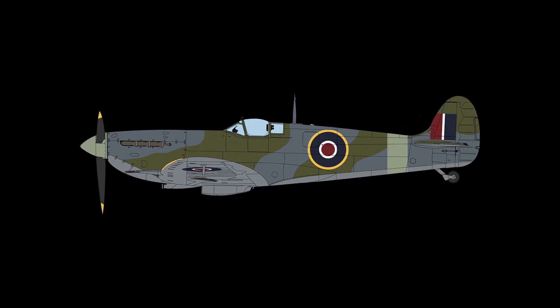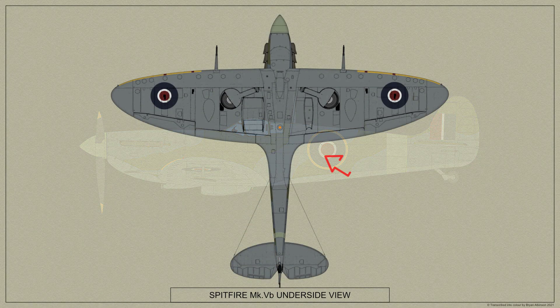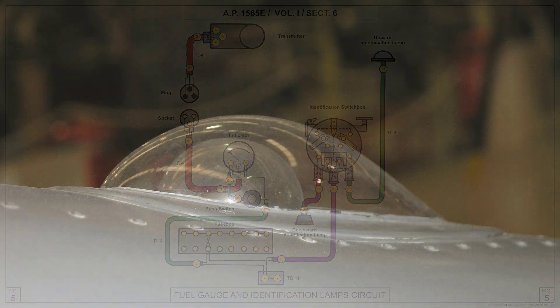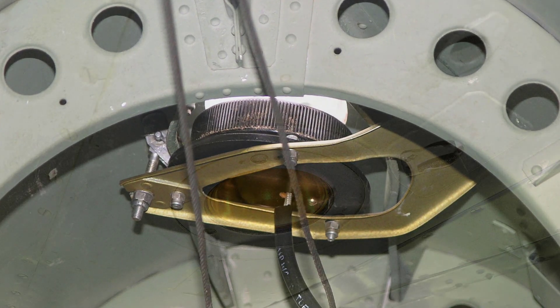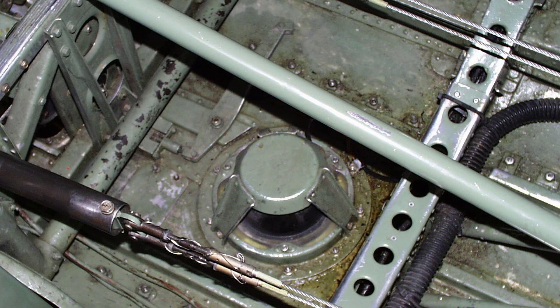The tail navigation lamp is inserted in a holder inset in the trailing edge of the rudder and is covered by a streamlined screw-on dome. The upward identification lamp is located after the aerial mast and the downward identification lamp is located on the centre line of the main plane. The purpose is to send a Morse code identification signal or steady beam from the aircraft. Here is a view of the upward identification lamp. The lower identification lamp in this case has an orange lens, and here is a view of the internal mounting point for the lamp, made visible by the removing of the pilot's seat.